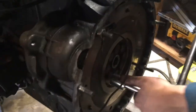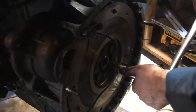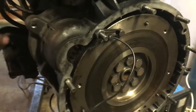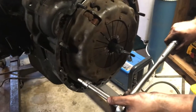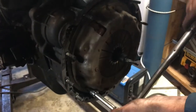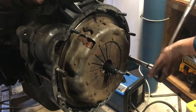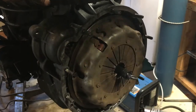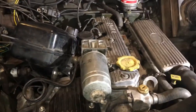The TDI flywheel goes back down at approximately 107 foot-pounds of torque per bolt in a star pattern. We tricked the system by putting in a bolt and a piece of about 10-gauge wire to hold things in place. Now we're doing our clutch — this is the Series clutch onto the 300TDI bell housing flywheel — at 34 foot-pounds. We didn't have the right clutch alignment tool; I've got one for a V8 300TDI clutch, but we were able to get it dead center, so we're good to go.